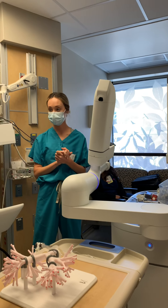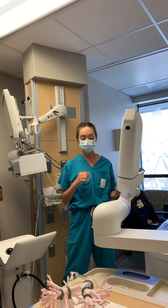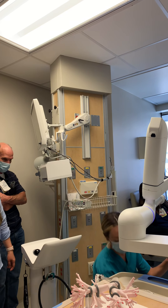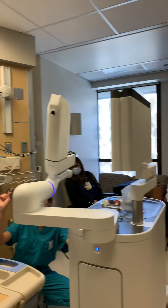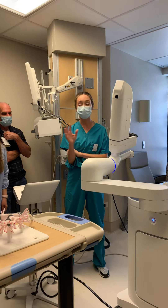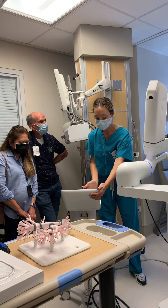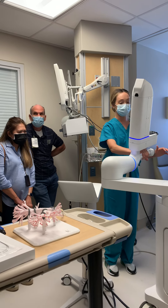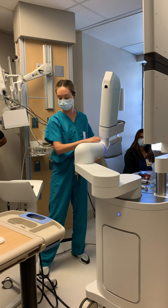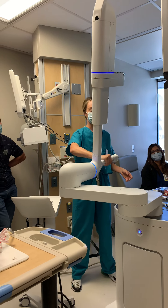Does anyone have any questions on that? Does the unit need to be plugged in at all times? Yes. So starting from the beginning — it has about a 10-minute battery life. So even when it's off and resting, just make sure it is plugged in. Before you turn the system on, this controller is going to be plugged in here. It has that same collar on it, so it will twist — you'll know it's in. Make sure that it is plugged in before you turn it on. If you turn it on and it's not plugged in, wait for it to boot up, turn it off, plug it in, turn it back on. It'll let you know if you made a mistake. But once that has occurred, it's going to prompt you to move the arm. Start new procedure — so from the beginning again.